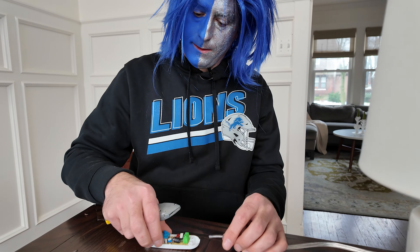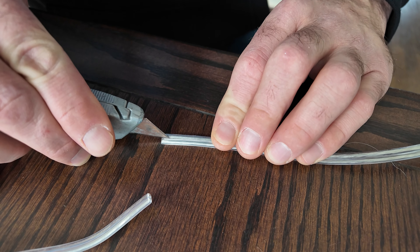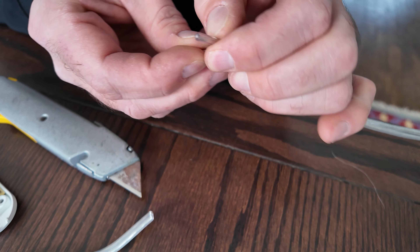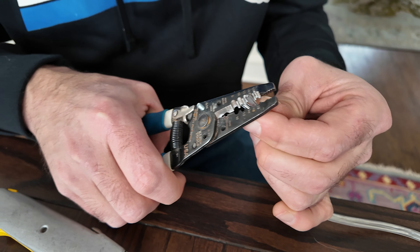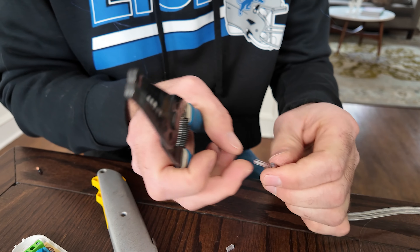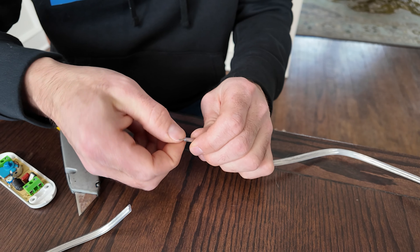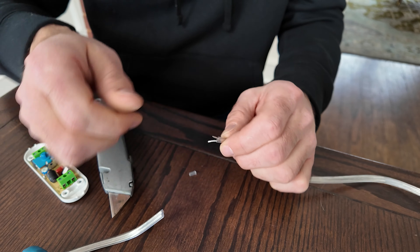The load is what carries the power to this. Take your utility knife and separate the two sides of the wire, just gently. You can determine which is the neutral by the wire that has a ridge on it. Strip down about three sixteenths of an inch — that will be inserted into the terminals in the dimmer — then twist the ends of the wire, giving it a nice solid contact point.